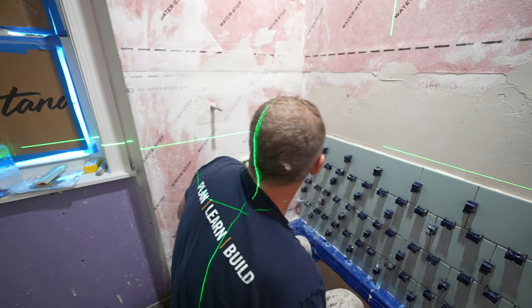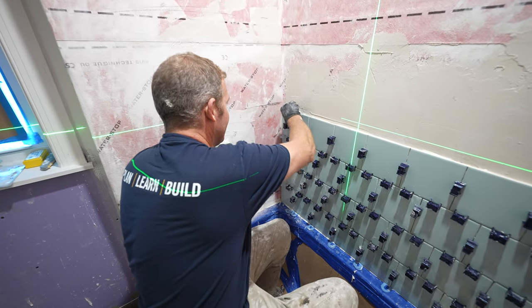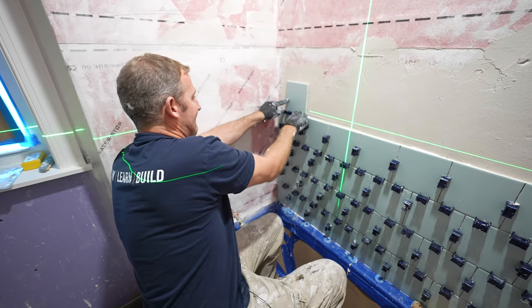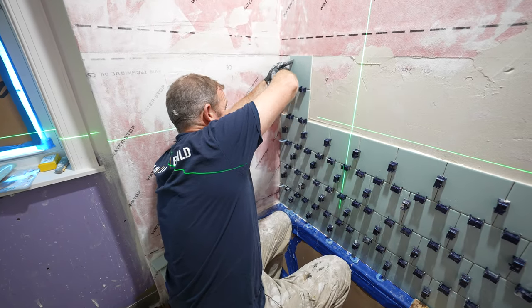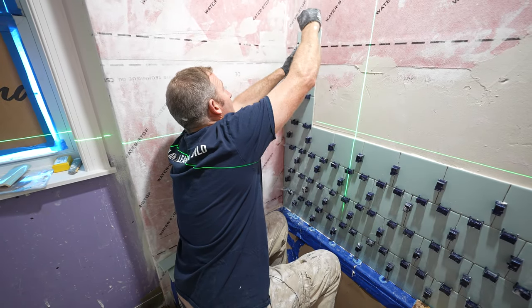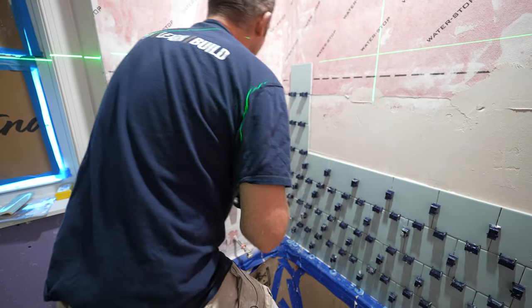Let's go ahead and check what we're gonna be at the top here. So we'll put our leveling clips in here so that we're 100% accurate. Okay, so that's essentially where we're gonna be at the top here. Let's get our laser up onto that one. Let's drop this an inch.